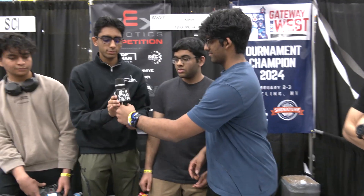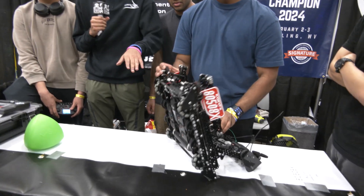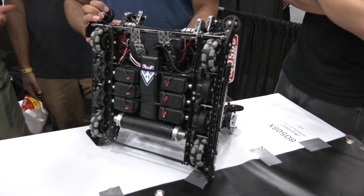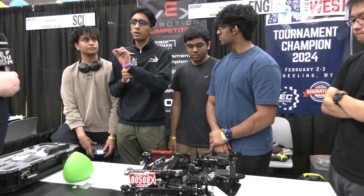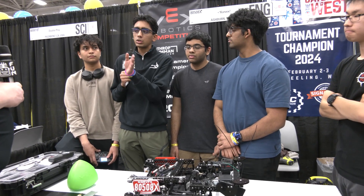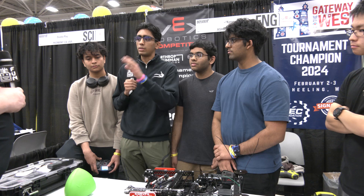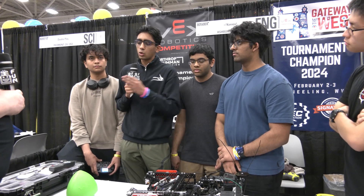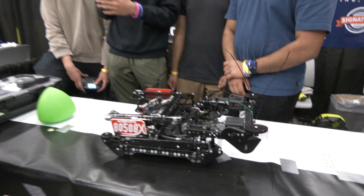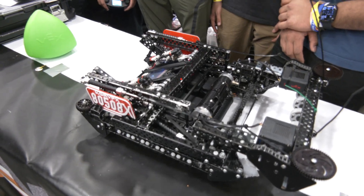Parker, let's talk about the programming aspect. We were planning on using odometry at the beginning of Worlds — planning on having tracking wheels on the base of the chassis. But the problem is with the flat bot, you don't have any space to put wheels for odometry. So instead, we decided to use Easy PID. Rather than just using simple movements, we chain our movements: about two inches before the robot gets to its desired location, it immediately starts changing direction toward the next target. We also reduce the stop time between movements by a significant amount, giving us cleaner, quicker movement chains. We run one route that looks like arcs the entire time — it looks like odometry when it's really just Easy PID.